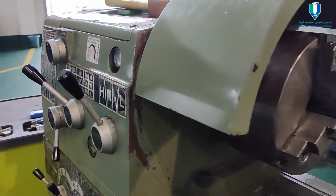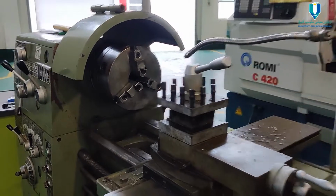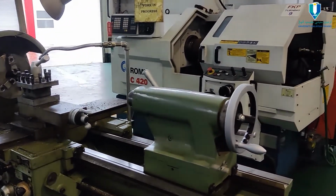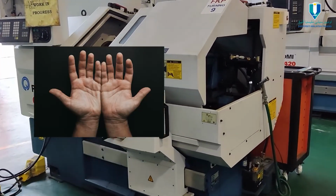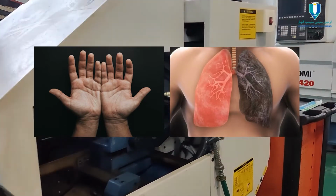To reduce friction between wear on the containing surface, fluids called lubricants, cutting fluids or metalworking fluids are used. The most common lubricant is made from mineral-based oil, but these mineral-based oil lubricants give a number of health issues like skin disease and respiratory problems, especially to those using MQL for machining for an extended period.